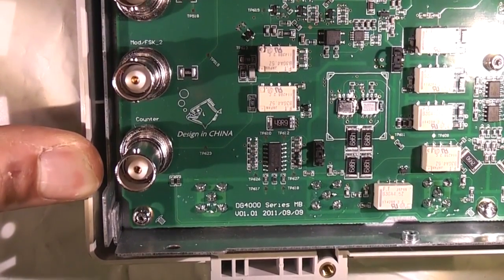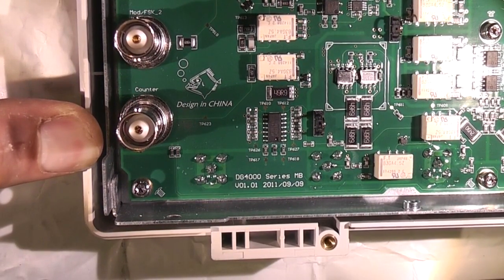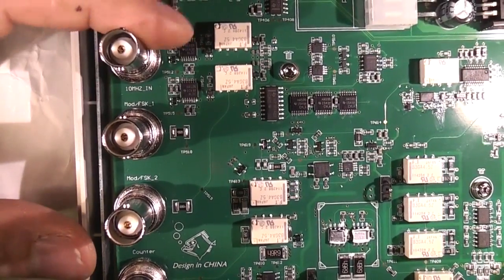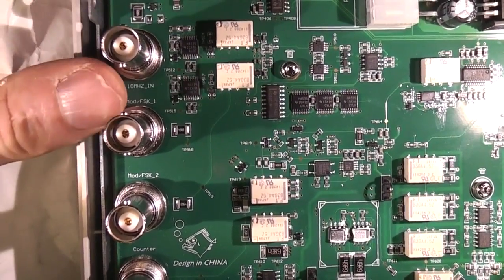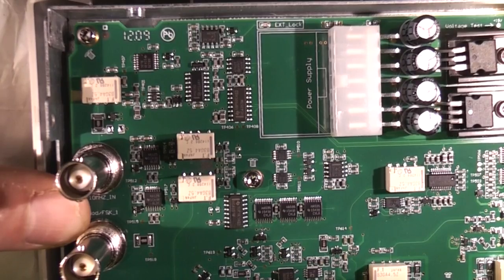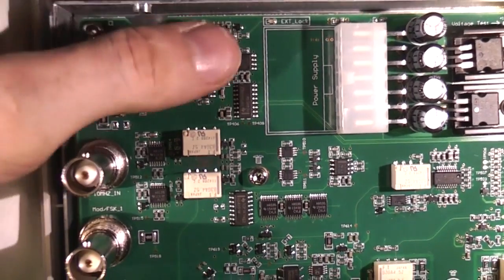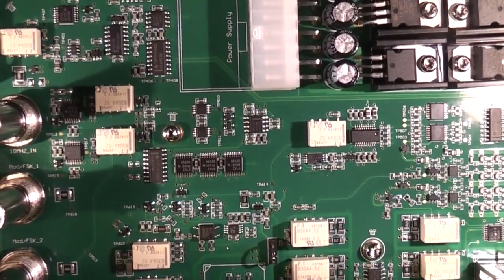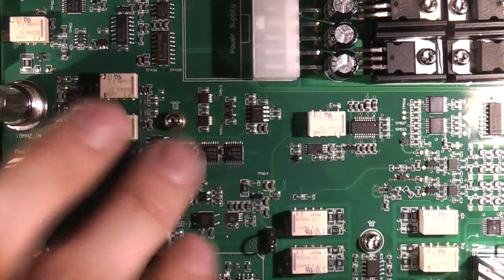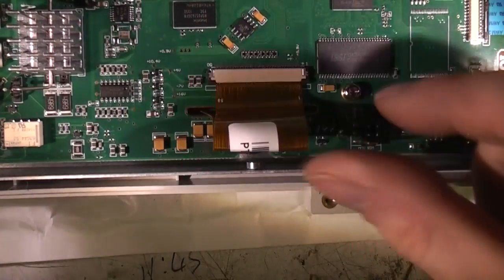These are the rear sockets. There's a little design 'made in China' with a little fish with bubbles coming out of its mouth — cute. Version 1.01, September 2011, so it's fairly recent, looks like probably one minor revision. Most of the stuff up here is interfacing for the rear sockets, with relays to select functions. Interestingly there's a thing called X-Lock — there's actually an LED which I'm guessing lights up when it sees the external 10MHz reference signal. And there's a load of HC-595s producing all the parallel control lines to control the relays, multiplexers, and all the digital selection on the output stage. Down here is obviously the flex from the LCD, and there's an Analog Devices ADF4360 frequency synthesizer.